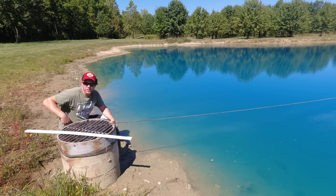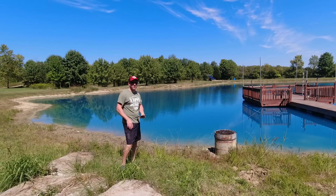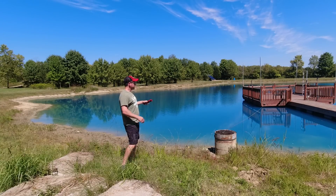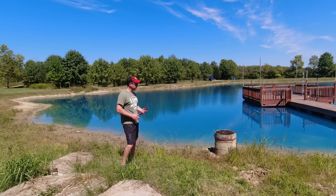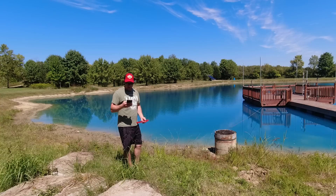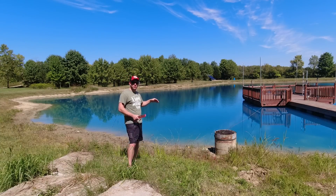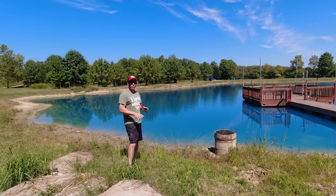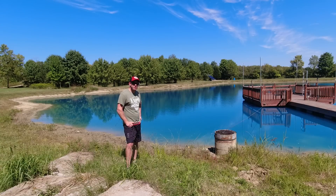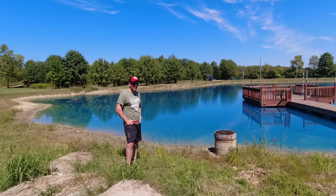An inch-acre of water is approximately 27,154 gallons, which works out to about 760,000 gallons over a true acre. Let's call it 700,000 gallons for fun. With no evaporation and producing 22 gallons a minute, 700,000 divided by 22 gallons a minute is 31,818 minutes — divided by 60, divided by 8 hours a day, that's 66 days before this would be full running 8 hours a day. My guess is that by the end of calendar year 2024 it will be full. Evaporation slows in September and October, we'll see heavy rains probably in November, plus any snow in December.